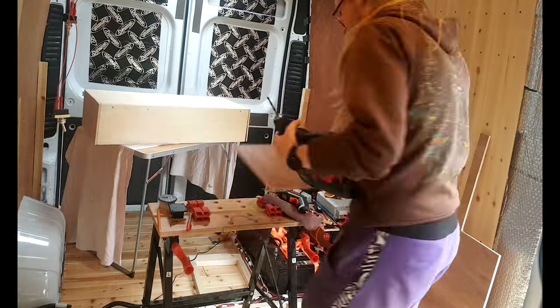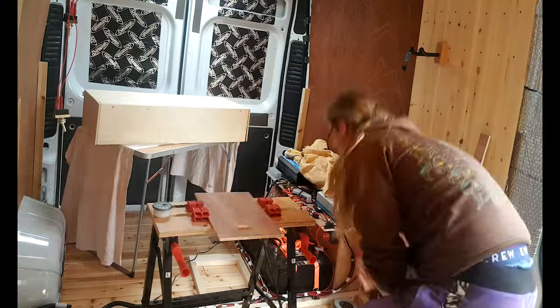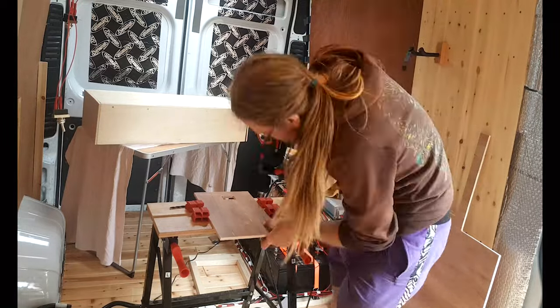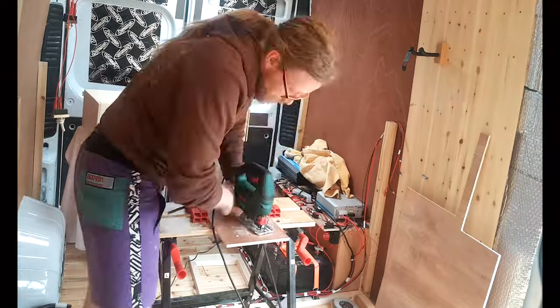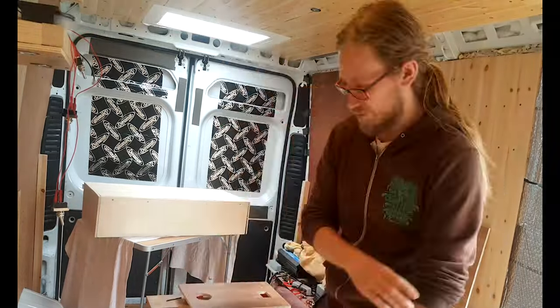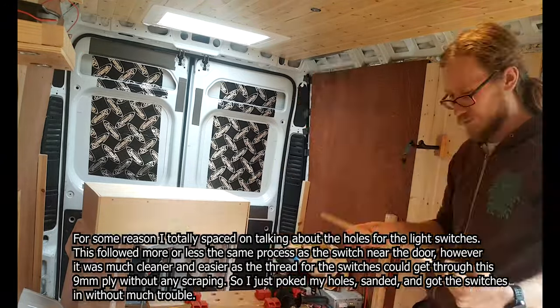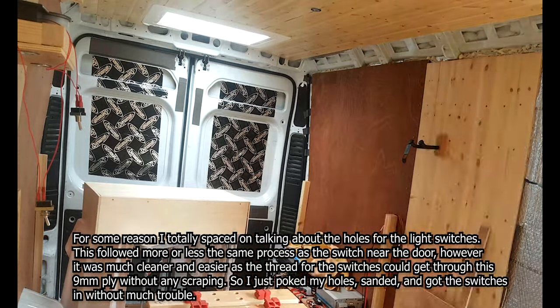I drilled four little holes using a four millimeter bit and then expanded them to bigger holes with an eight millimeter bit, which is just about big enough to fit a jigsaw blade in, and then cut to join the holes up in a semi-circular or rectangular manner. The circle was definitely a lot harder to do than the rectangle because you're constantly turning. Thankfully you do have a bit of wiggle room because there's always a bit of a lip that sticks out over the hole, so it doesn't have to be perfect, and both have a mechanism for securing in place.